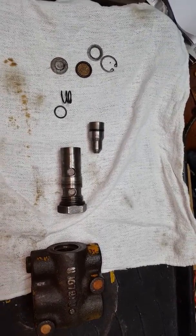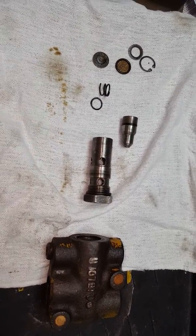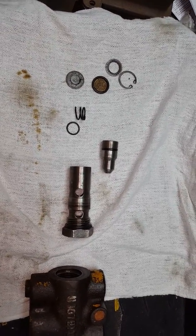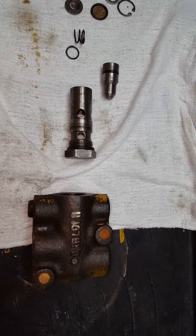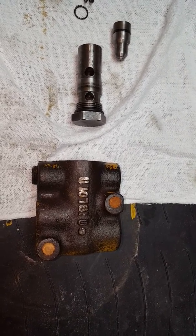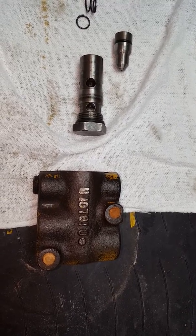I can't build pressure. I have a pressure gauge on it and when I try to use anything I can't really get max pressure out of it. There's a system pressure relief valve that goes on most of them — sometimes they mount them by the pump and sometimes they mount them pretty much anywhere in the system coming from the pump.